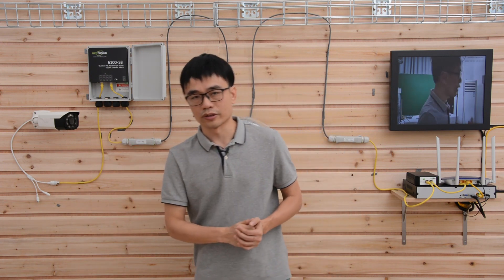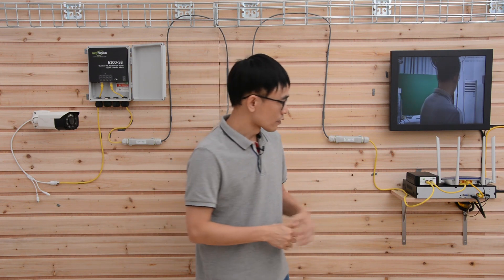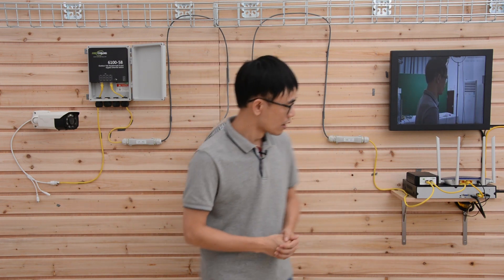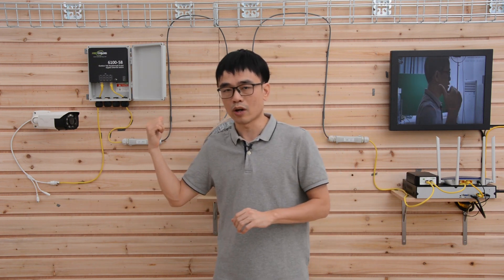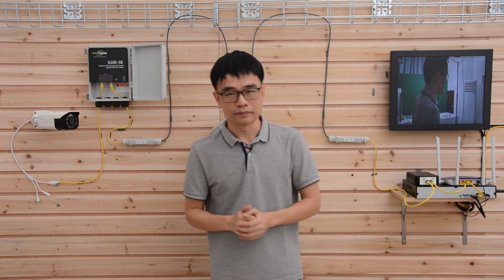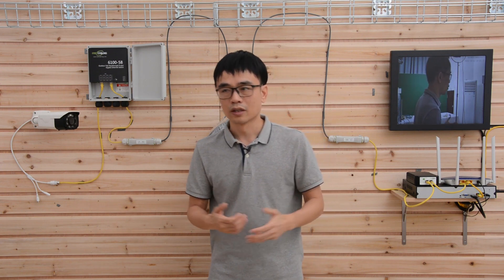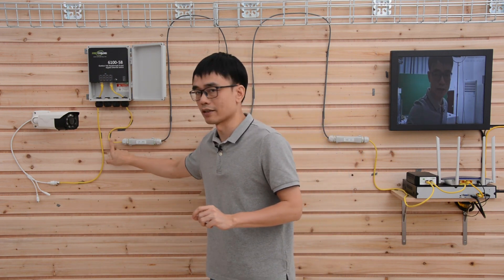There's another important point. Can you just use a regular PoE switch — not a switch with the PoE power-in feature? It will also have a problem. In the standard PoE solution, there is always power handshaking. Before the PoE injector can send power to the edge, it needs to classify and verify that the edge device can accept power. In this case, that device is the outdoor PoE switch. As mentioned earlier, one of its ports can be powered by another PoE injector, meaning it is a PoE device. So if you use a regular switch at the edge, the PoE injector will not send power, the PoE extenders won't get power, and the whole link will not come up — it will not work. It's very important to use a PoE-powered switch at the edge, or you can add a PoE splitter after the PoE extender, which will also work.